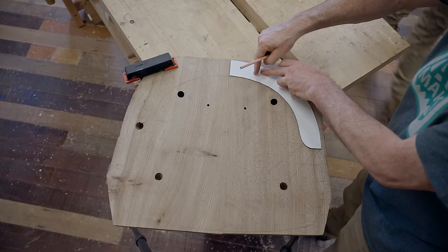We're shaping them down to the perfect thickness for a nice fit into the leg slots. We then shape the section flat where they fit into the bottom of the slot so they're fully seated. We do some final shaping and then we put the rockers aside.